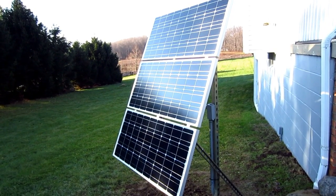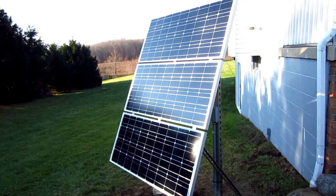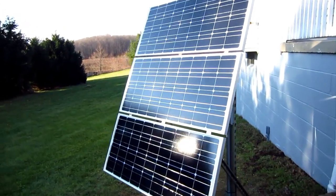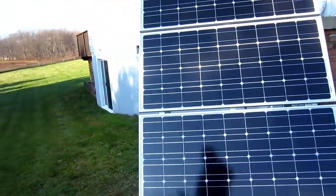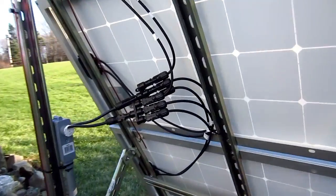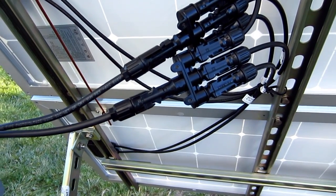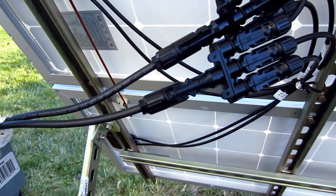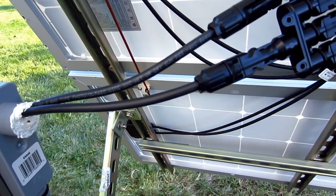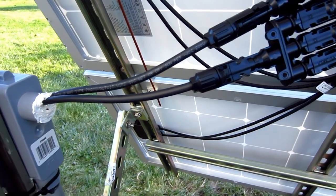First, I want to let you know that this was designed to meet the current NEC guidelines, which changed quite a bit. You can see the three Renogy 100-watt panels — they're wired in parallel and they will charge the 12-volt battery system. Stepping behind, you can see I use three-to-one connectors; these are MC4 connectors, and I bought 30 feet of connectorized 8-gauge MC4 cable.